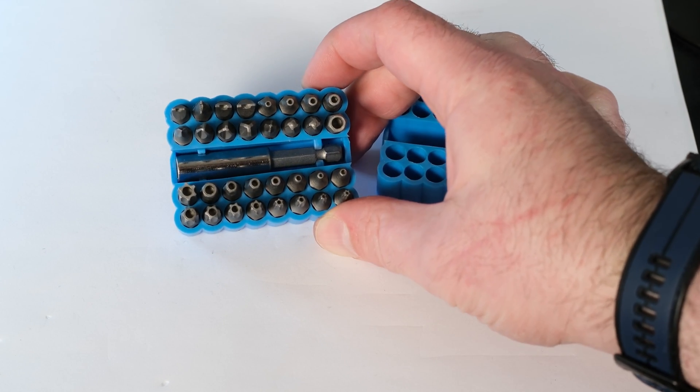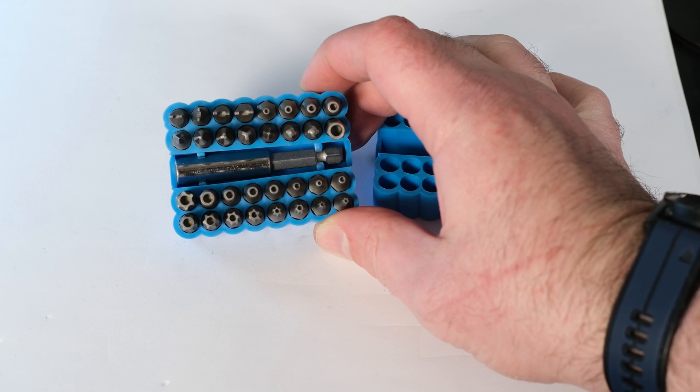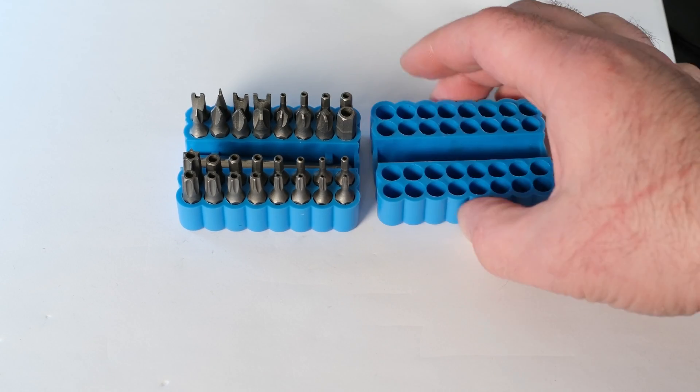All right, let's go get a good-ish derailleur and try to disassemble that. It was around this time I recalled having found out that on one side there's a five-lobe torx and on the other side there's a six-lobe torx — so people don't disassemble it, I guess. That's annoying. But I was prepared: months earlier I had bought a set of security bits for the express purpose of this. So I got them out — and it doesn't have five-lobe torx in it.